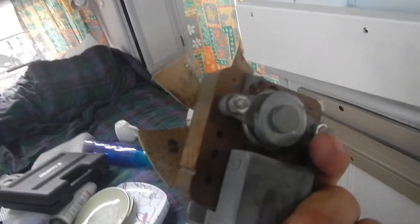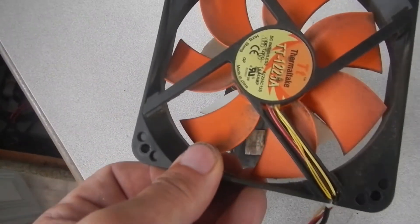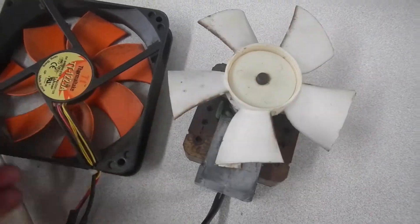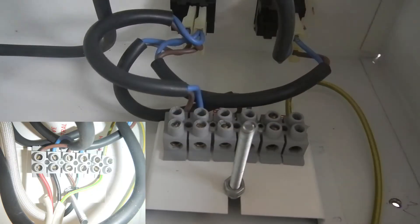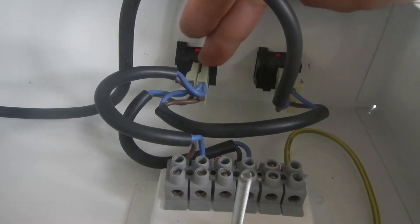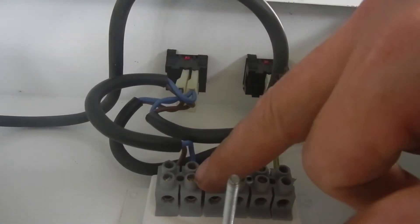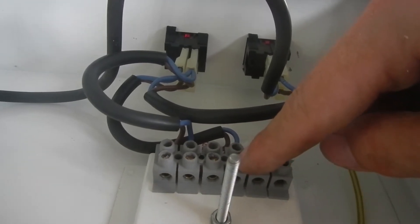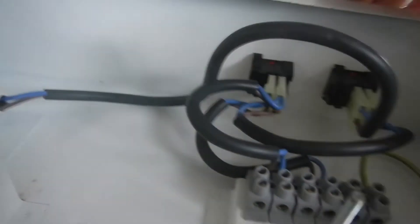If for whatever reason you need to replace that fan, that's roughly what the original looks like. We're going from that to that — this is an 80mm fan here, and the original is probably something closer to 60mm or a little bit less. I've paid attention to see what's going on, and you can see this is where the power was coming in, which goes into this switch. They've jumped this switch over to this one directly, so this one is receiving power off this one. Then this switch was going back into these two points here, switching the fan itself. So ultimately all I've got to do is apply 12V to here, just these two connection points, plug my fan back in, take power off here, and then cut these off and connect them to the LEDs. The job should be good — this could be much simpler than I thought.